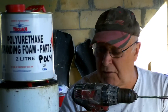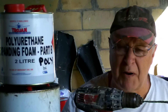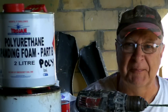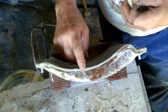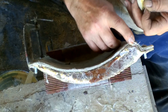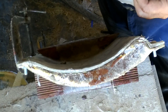You're not going to be able to see it rising in the mould because the wing and the mould are both opaque — but you'll see it come out the top, that's for sure. Although I've got a really good fit on my mould ends, I'm going to put some tape over this joint just to give myself a little bit of insurance against unwanted leakage, because expanding foam will always find the easiest way out.